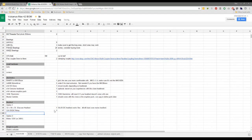I just want to mention this because it's quite a big thing for me. I got a cheap Chinese relay, completely useless, got too hot to even touch within about 60 seconds. I would go automotive relay. You can get them really cheap, £3 or £4 in the UK. I imagine they're just as cheap in the States, and they're completely fine. So I use a 12 volt auto 40 amp relay. You might want to put your amperage down on your relay.